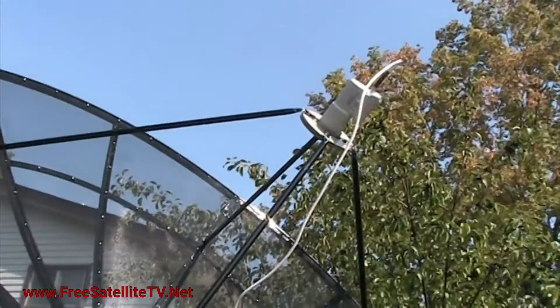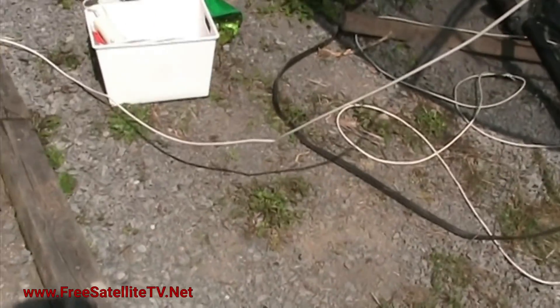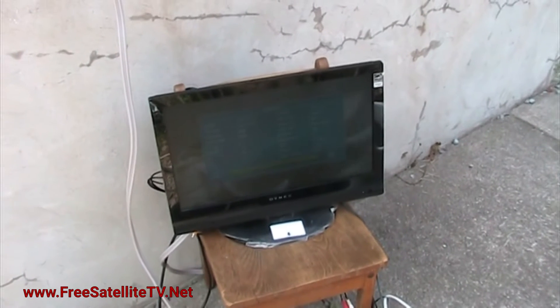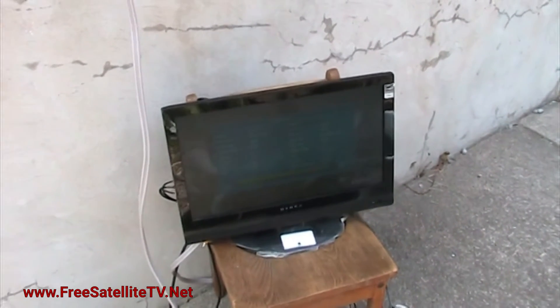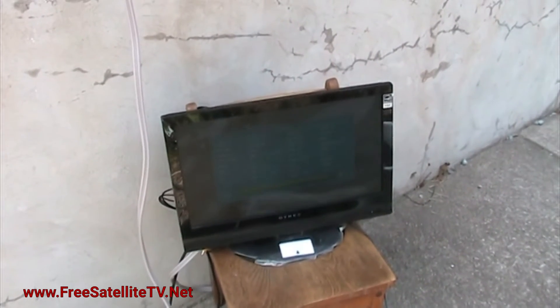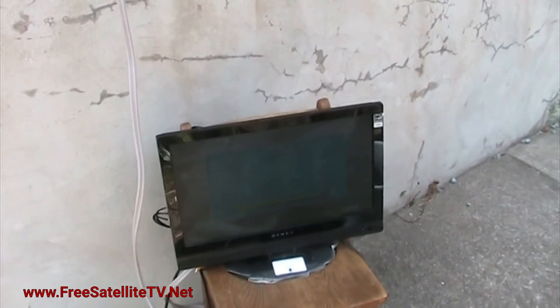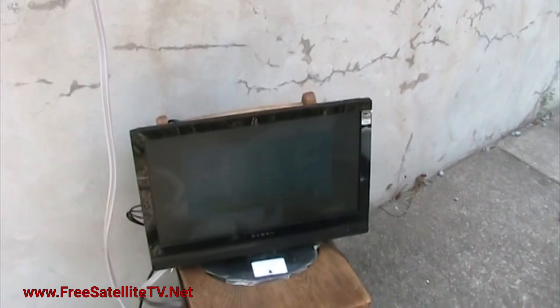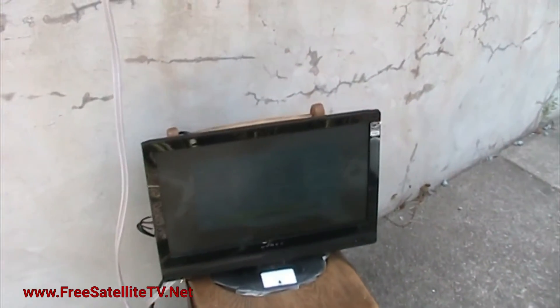I attached the LNB and I just have a temporary wire running down from the LNB to a receiver, my Amico Mini. I'm on 91 West and Light TV is giving me about 20 to 30 percent signal. I probably just need to mess around with the azimuth. This is my true south — my zenith satellite, the satellite that is the highest in the arc.